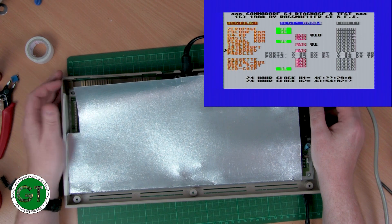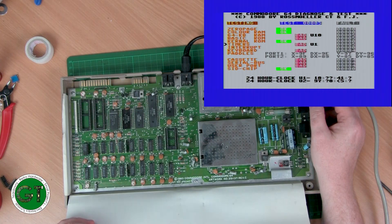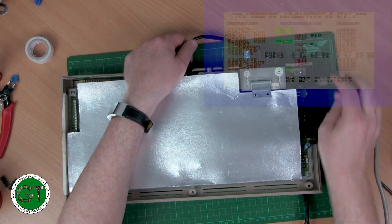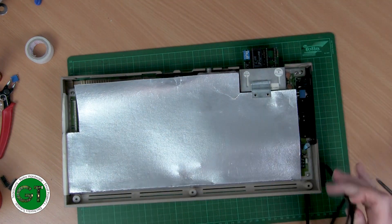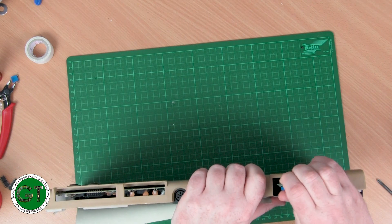The Dead Test shows zero-page colour RAM bad, and it says U10 is bad. Obviously the timers are bad too because there's no test harness on here. Bizarrely, it says the SID chip is okay, which can't be true because it's missing. So let's get this machine taken apart and see if we can get that RAM chip out and get this thing back to life.